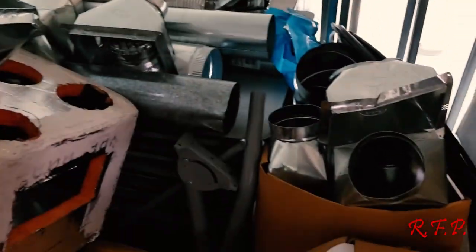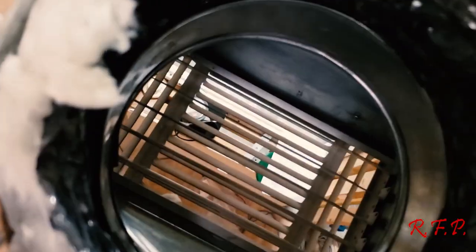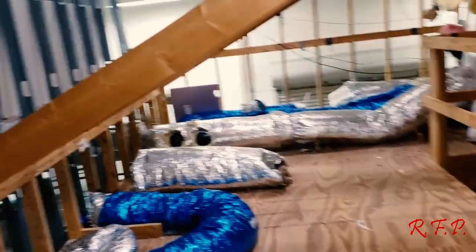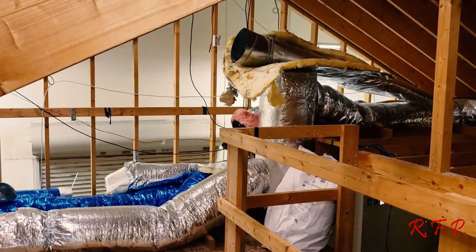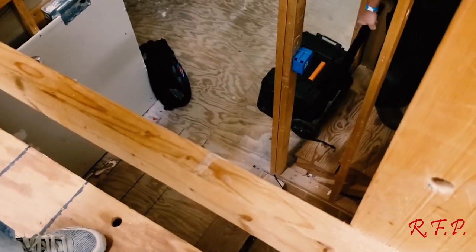Yeah. You got to pull the Freon down. You gotta cut your copper, you gotta braze it back, vacuum it down, release the gas. That's a half a day job if you gotta clean the coil like that. And you gotta have the right couplings on the truck or whatever. If you mess up and ain't got the couplings on the truck, you cut the lines. Now you gotta go to the supply house and get some couplings. Just bring a new coil.